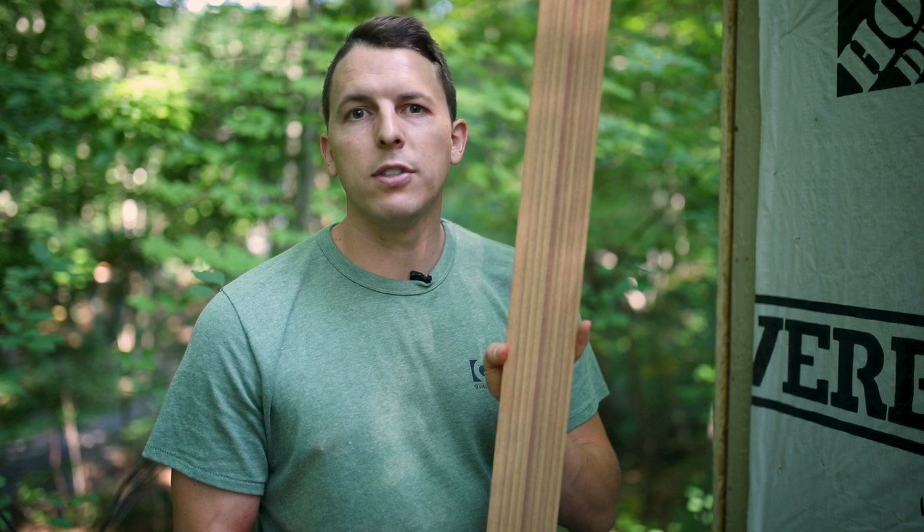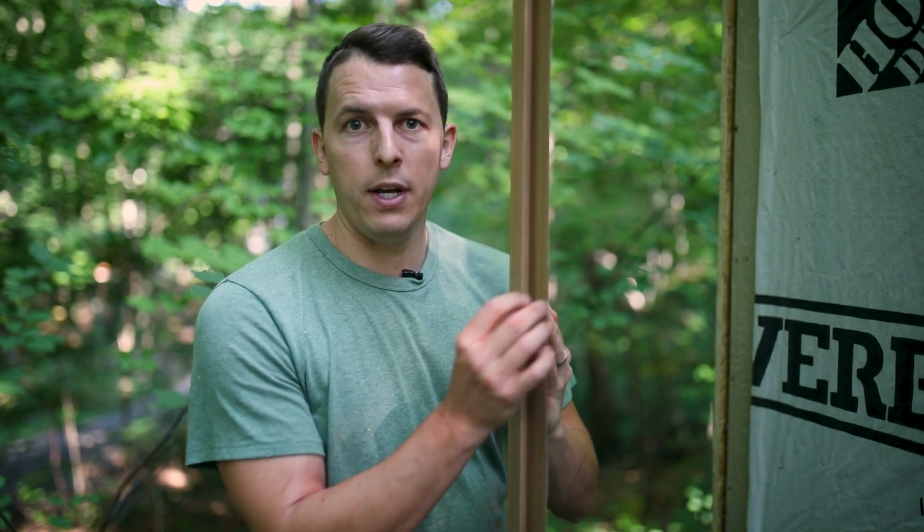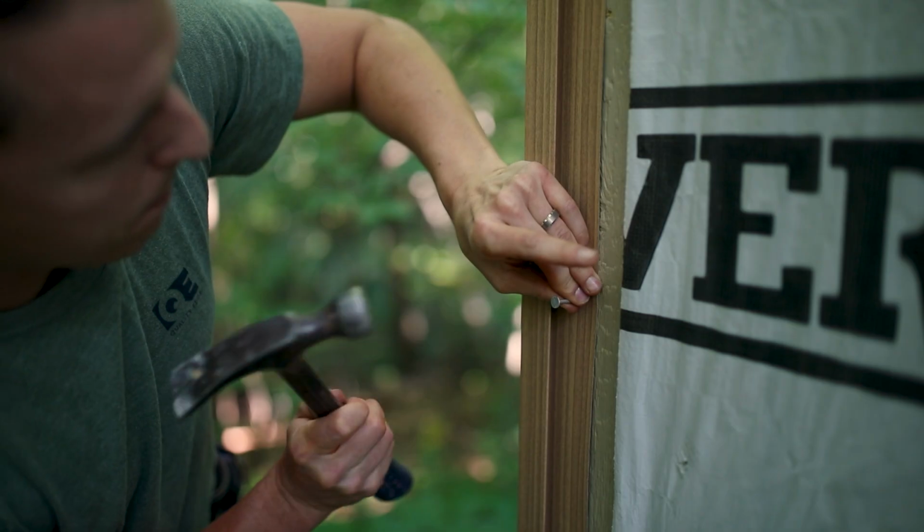This is our slim outside corner piece. It makes it really nice because we have just one nail flange and it can receive the other end and then also receive our facing end. We're going to put this on the corner and then we'll slide our Vesta plank into there. When we install corners, accessories, and J channel for Vesta, we're going to nail all that tight. It's going to be different than how we install the Vesta panel, but we'll get to that later.